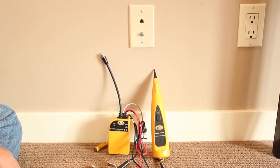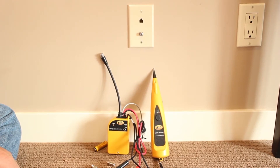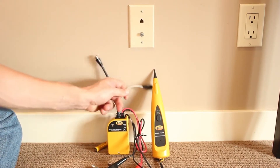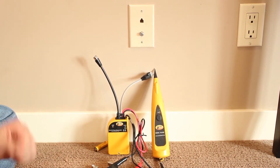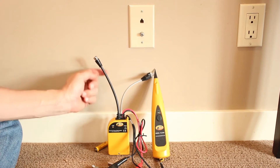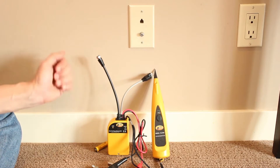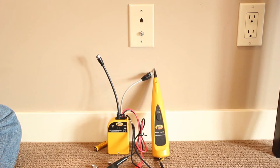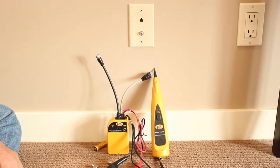Today we're talking about how to tone out a cable TV coaxial cable system. Most tones and probes out there are designed for telecom or networking, and this one has that capability too — that's what the alligator clips and the RJ connector are for. But what makes this one different is that it has a hardwired F-connector male plug coax adapter, which is almost unique in the tone and probe world.